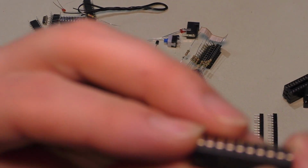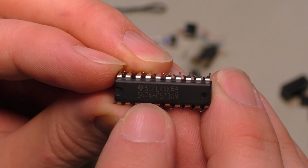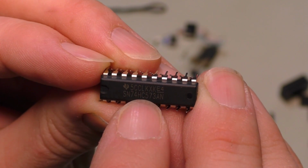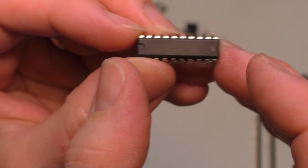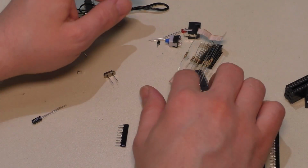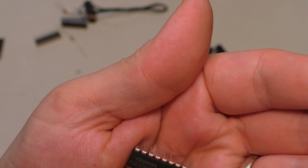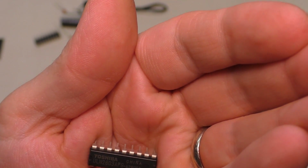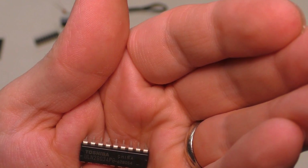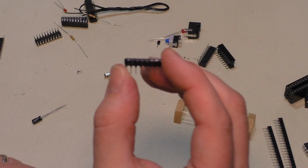We have here the shift register. This is an SN74HC573AN from Texas Instruments. You get eight of those. Of course, we have the Darlington driver over here. This is a Toshiba ULN2803APG. I'll put links in the description to the data sheets if you care to look at all these.